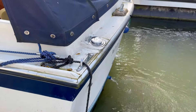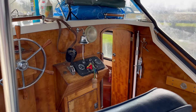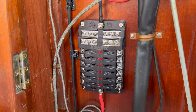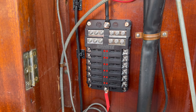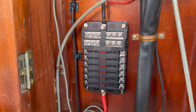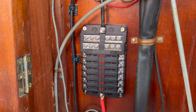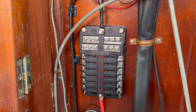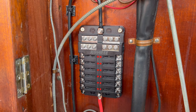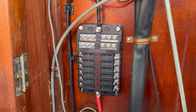So now with her up and running we can get on with a couple of other little jobs on the electrics. Now with the new leisure battery fuse panel, I'm going to start transferring a few circuits over to this. First I'm going to do the 12 volt cigarette lighter sockets and then I will look at installing some USB sockets as well. But ultimately I want to move all of the leisure items over to this fuse board so we're not draining the main battery when we're using lights or anything like that.